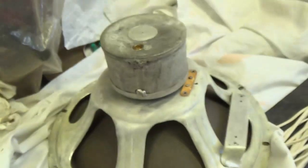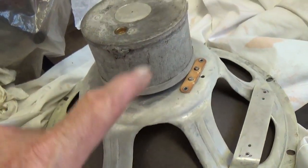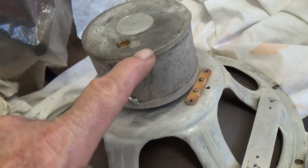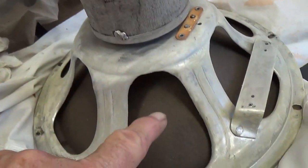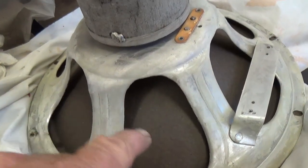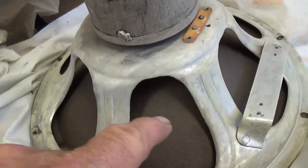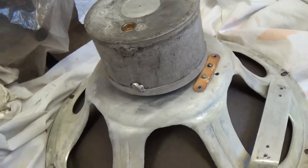And that's probably why I've had such good results with these types of speaker, because the Alnico magnet I think is much larger and for some reason maintains its field strength and also can maintain control over that cone so that you get really good clear response even when you pump some watts into one of these jewels.